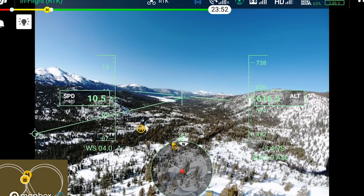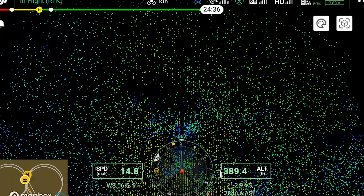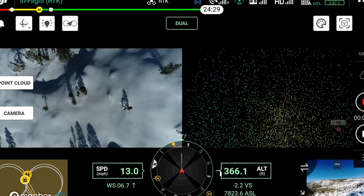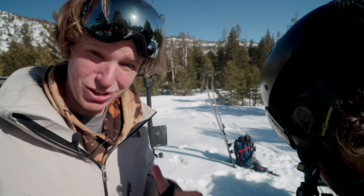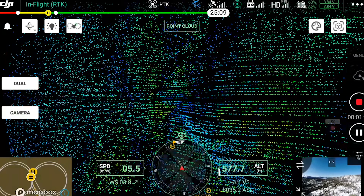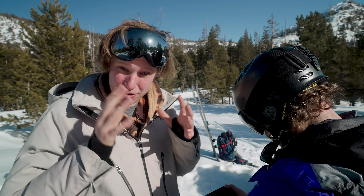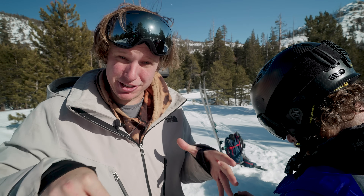It's looking like we have four main views. You have the FPV camera like you always can see on the M300, but also you can see the point cloud view in real time. You can see the actual camera from the L1 — that's a 20 megapixel camera. You can do split-screen mode. And there are two different ways to look at that LiDAR data: either the live stream as you fly, or the global view, where you can see the LiDAR data being populated on a fixed plane — not in the reference frame of the LiDAR, but in a global reference frame, seeing the map being built in front of you.